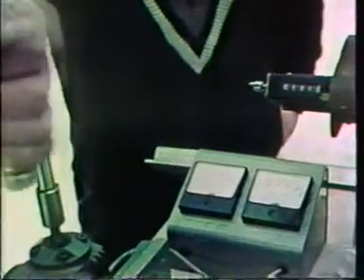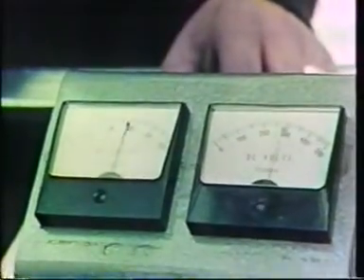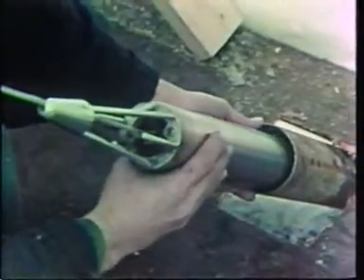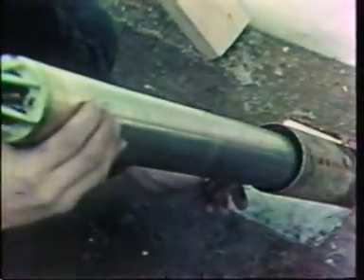Here in this animation the camera is passing a fracture. The controls for the flash and the film advance are connected to a hand crank, and the operator controls the movement and the rate at which the photographs are taken. Here the camera has passed the fracture having photographed it. About 75 feet of drill hole can be photographed each time before the camera needs to be reloaded.